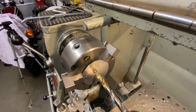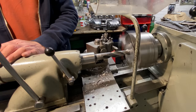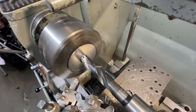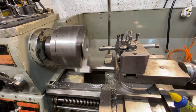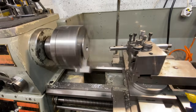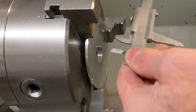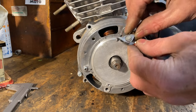With the outside diameter machined, the next thing I've got to do is bore a hole in the centre — 26 millimetres diameter — to fit over a protrusion on the side casing. I use a succession of drills and then finish off with my boring bar to get the precise size. With the machining complete and the bore size checked, I offer it up to the engine and it fits just perfect — slides on really nicely.